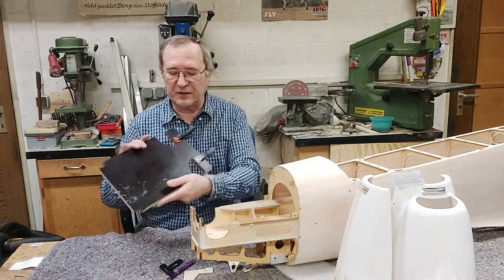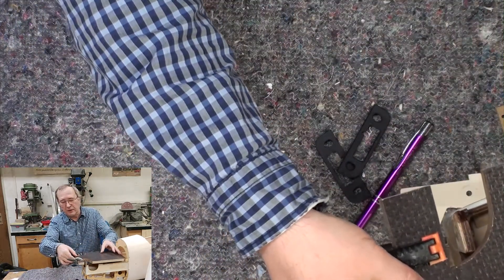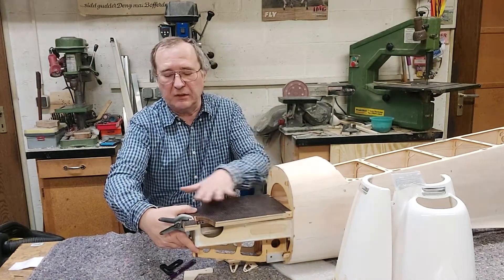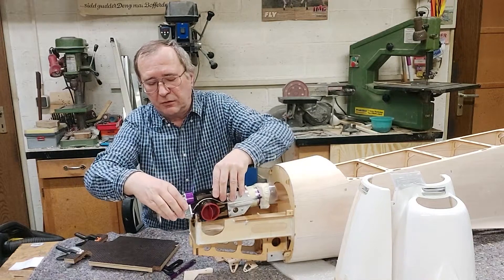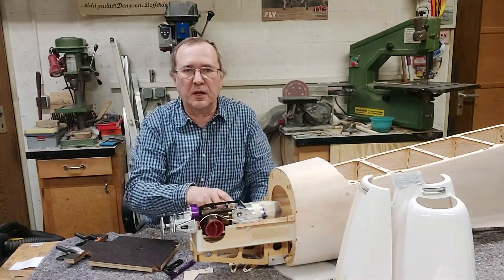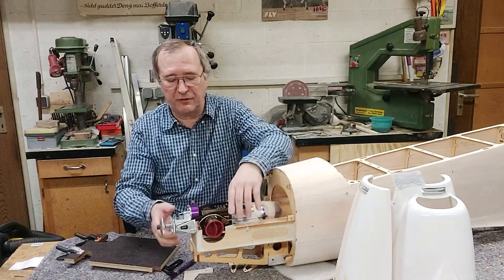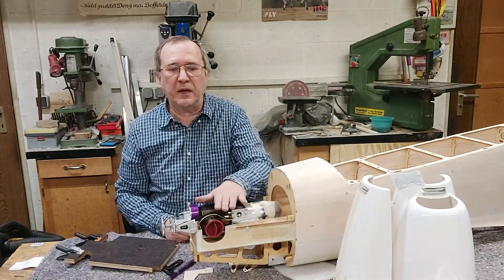Once we had the holes in front straight, we made this board — I had two two-millimeter pins just clamped against it to go into the two holes, and as they are two millimeters flat against the bottom wall of the holes, the underside of the board is exactly the surface we need to mount it straight on. You could also refer to the front holes and put some thin plywood or fiberglass sheet under the ears, but we chose to have the whole surface flat so we know where we are anywhere on the surface.